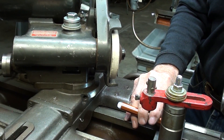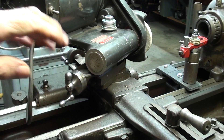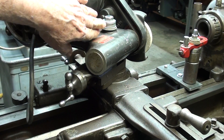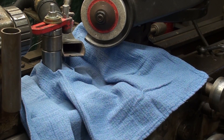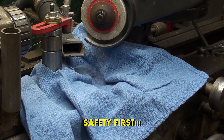It's tightened down securely. I will be doing all of the feeding with the compound — the carriage itself will be locked, and I will use the cross slide only for the depth of cut, which will not be very much. The switch is right here, which is a rather awkward position. This is the only grinder I have with a full belt guard, so that makes it a little bit safer. There's a certain hazard with any kind of machine shop work, particularly with grinding, so I'll be wearing a full face shield and just being very careful. Possibly one might want to wear a respirator because there will be dust in the air, but I am using the vacuum cleaner, which will suck up a good part of the grit.